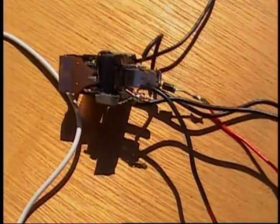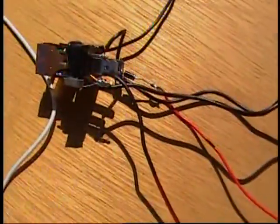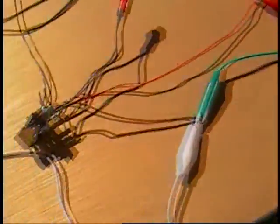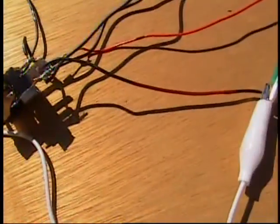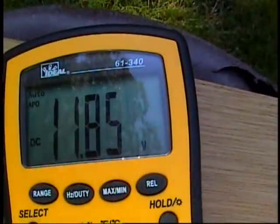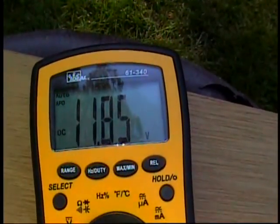I think it'll be good to use multiples of these — one solar cell should be able to drive about four of these little guys, because this thing's only pulling 30 milliamps. Almost nothing. Imhotep, thank you. Great circuit — I can't believe it's so simple and so effective. It's extremely impressive — almost nothing in the way of parts or cost, and it's squeezing voltage into the big battery. That's pretty impressive. I'll do some time trials and see how much energy I can produce with that little booger. This is Ron, over and out.